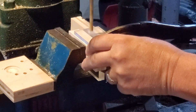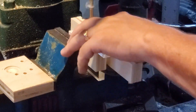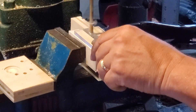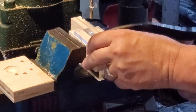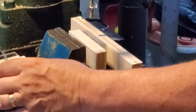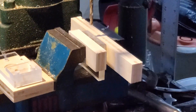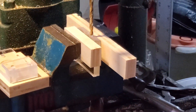What I did off-camera — because I forgot to hit the record button — is I clamped the bracket section where the pipe goes through between two pieces of three-quarter-inch plywood, clamped it in hard, then lined up the drill bit for the second hole. Then I placed the part that's going to hang on the tank, clamped that in place on top, and that allowed me to drive in the rod.